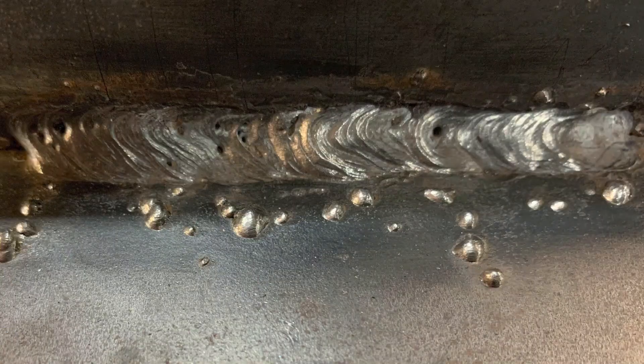We're going to look at a few different reasons why a weld fails. Reason number one: you're not reading the puddle properly. You never know how your weld is going to turn out. You've done this probably about a hundred times — you get the first couple of inches in good. You're confident because you've done this a whole bunch of times before, and then somewhere along halfway you lose it. Your arc length goes, your angle goes, and then the rest is a mystery. Does this sound familiar? The result? A jumbled mess.